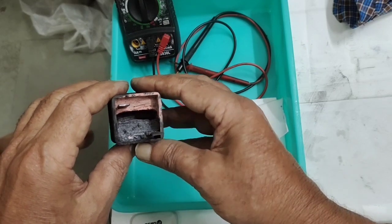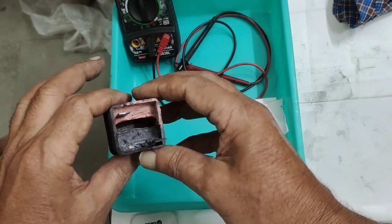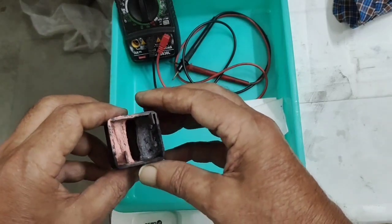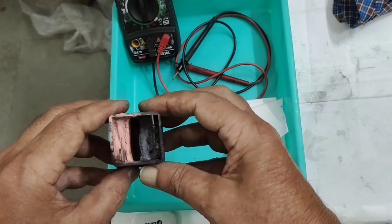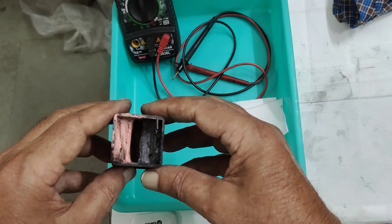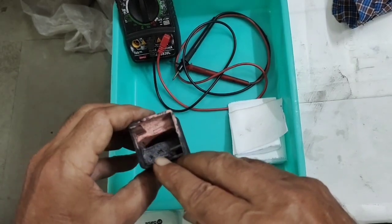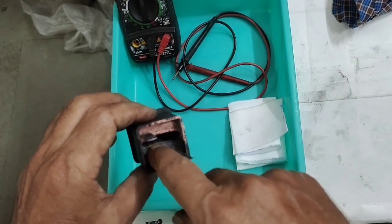For the negative electrode, I have added 25% carbon. Normally we only add 1%, but this time I added 25% carbon to make this cell more easily and instantly chargeable. That is what we are looking for — it should be instant chargeable. A lead acid battery that is instant chargeable will be ideal.